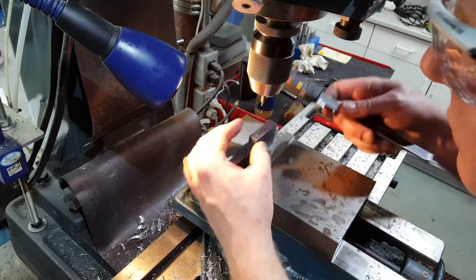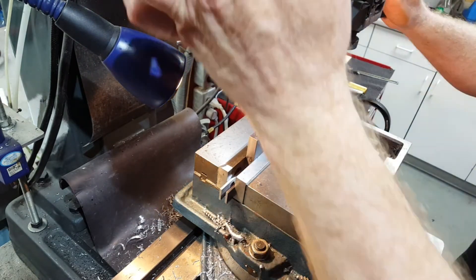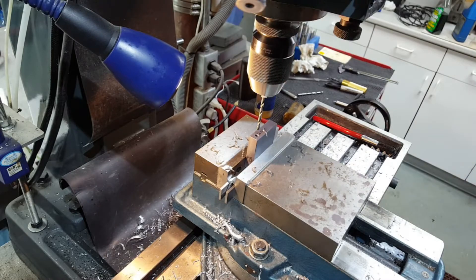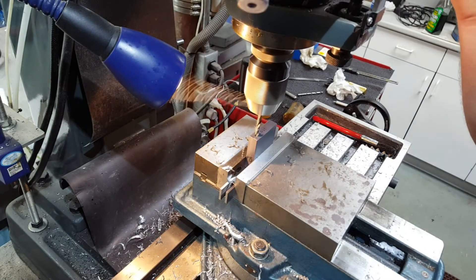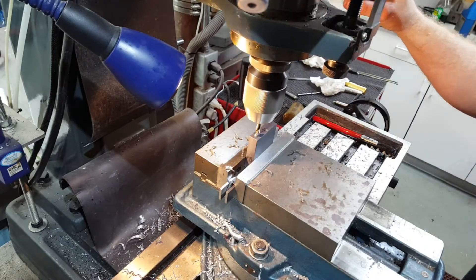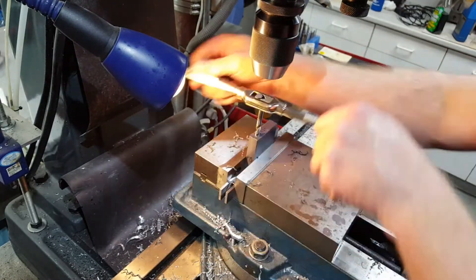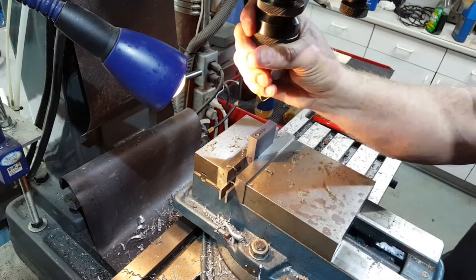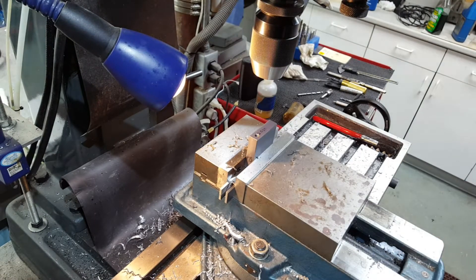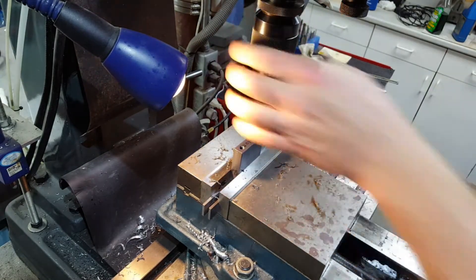The back part of the torch clamp is made from some 1/2 inch Nylatron that I had lying around — I bought a bunch of this stock years ago so it's really nice to use for projects like this. I chose the Nylatron because I didn't really know for sure if I would need to electrically insulate the torch from the rest of the body of the ChopBot. There are some electronics inside the control box, namely the speed control electronics, and I didn't know if there was any possible way to zap those by having trace voltage from the torch transfer through the body. So this was just a precaution — simple enough to do since I had the material. If I change my mind and want to make another back clamp plate out of aluminum, I can always change the part. It's just one little square with two slots and two holes.